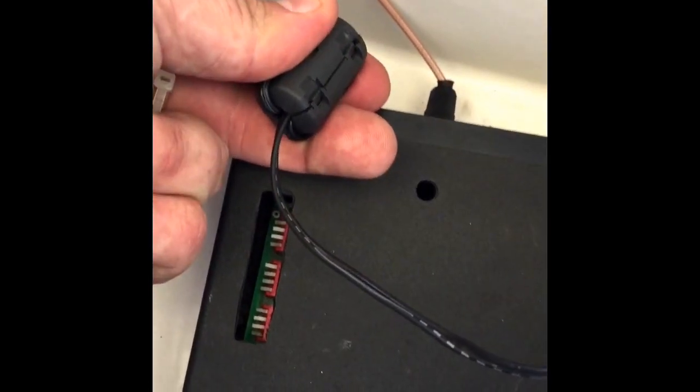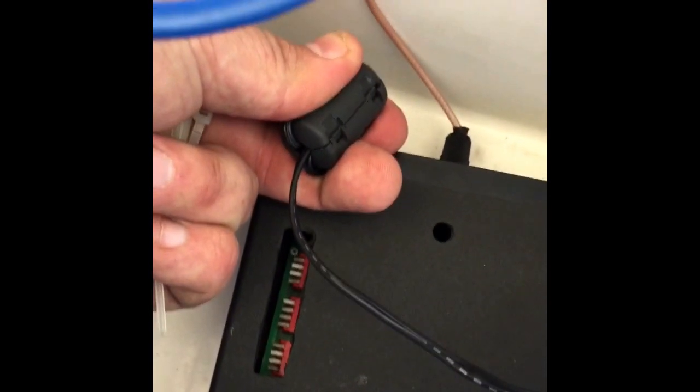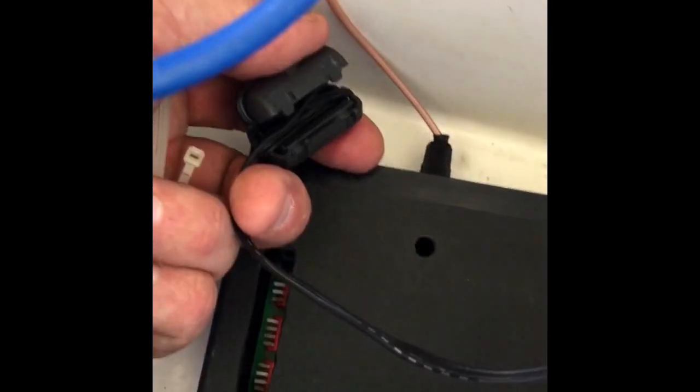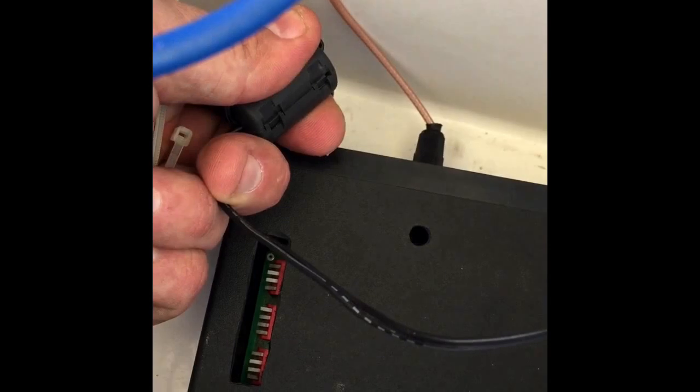I just went ahead and put the RF choke on here and you can hear there's no hum coming from the radio. But if I open it you can kind of still hear it. So what I did is I just wrapped it half a turn around one side and then wrapped it a turn around the other side, and when you close it down you don't hear it anymore.